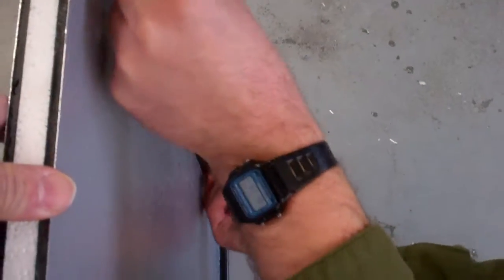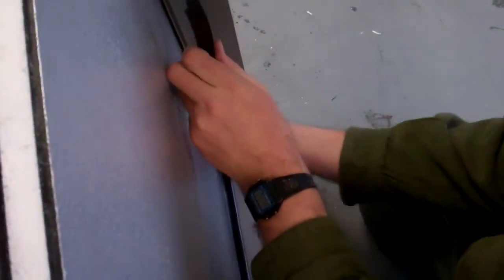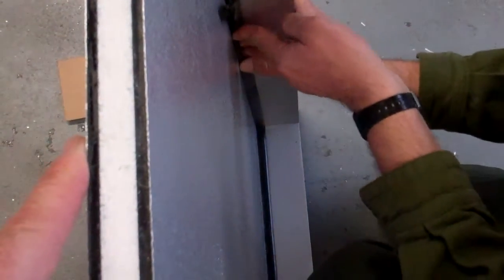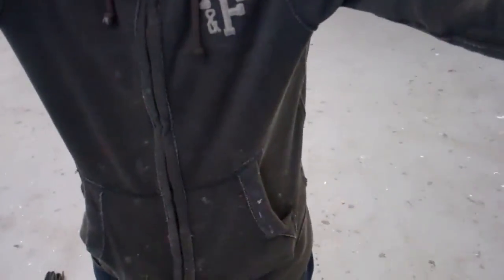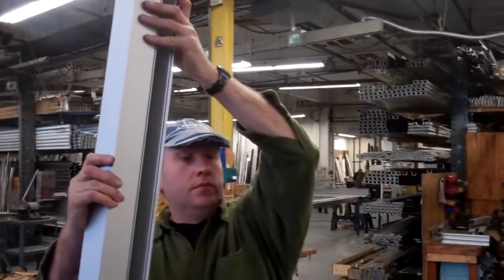It makes a nice, snug, tight fit, and then the glass is nice and tight in there, and all the corners are sealed, so there's no problem. And you do that all the way around for all 4 glasses. When the glass is finally completely installed, we are going to lower the frame this way so we can show you how to snap the head filler into the head. Typically the frame is already installed, but just for ease of operation, we're going to show you.